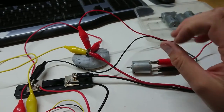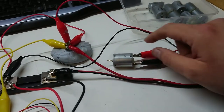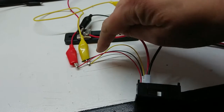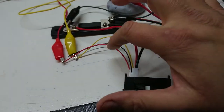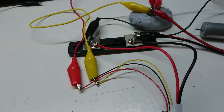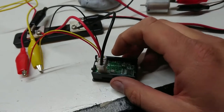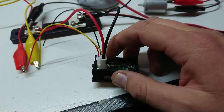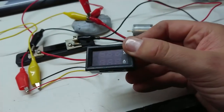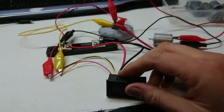Let's recap what I've done. Our big heavy wires from the existing shunt go to the bigger shunt terminal. Negative from our supply input comes into the shunt; negative to our load runs off to this motor here — of which I have many thanks to a fellow from Leonard Audio. Our positive from the load goes back to our common positive block, which goes to both the red and yellow wire. I think one is supply for the meter and the other is backlighting or voltage reading supply.